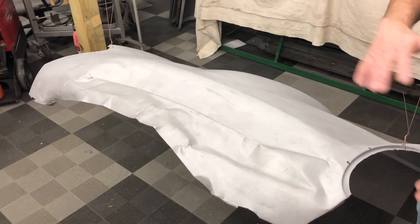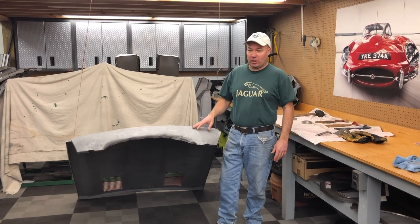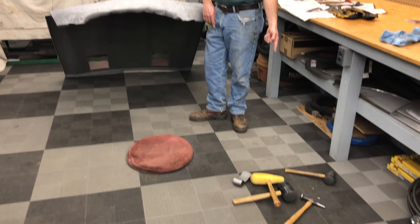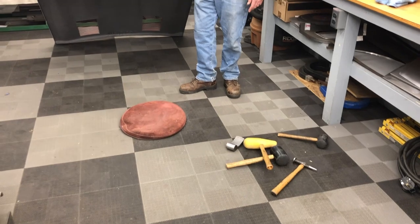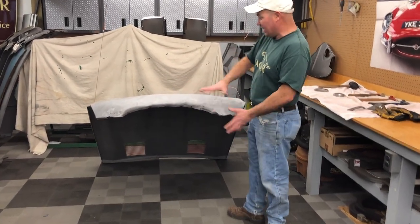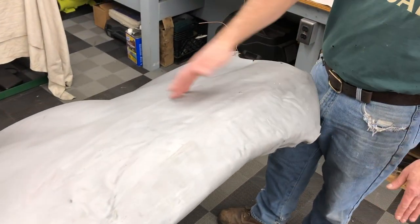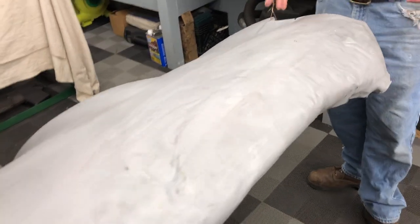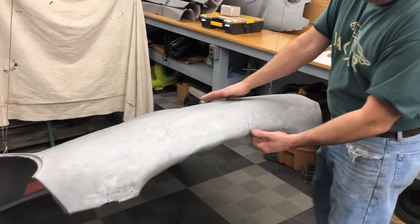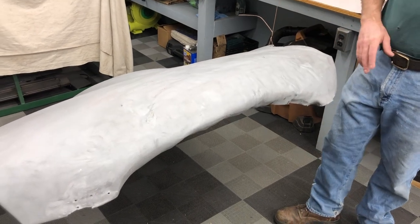It'll go back into shape real quick, but then to get it a smooth, perfect shape will take more and more time. So I think that was about 15, maybe 20 minutes. Brent stood back there and held it upside down on the shot bag. There are the tools I used — a couple of rubber mallets. I had the dolly so I could kind of wrap the mouth a little bit, and then I had that spade hammer to get in there because there was a tight little crease right here. All I've done now is try to get those big creases out, trying to be gentle with it and always thinking push instead of hammer. And now I've got a crease going this way here and here, so I'm going to work the top for a little while. You've got to put the shape in before you start smoothing things out or you're getting in trouble.